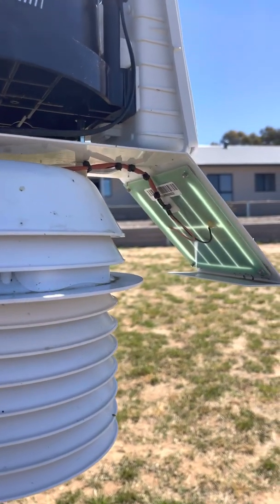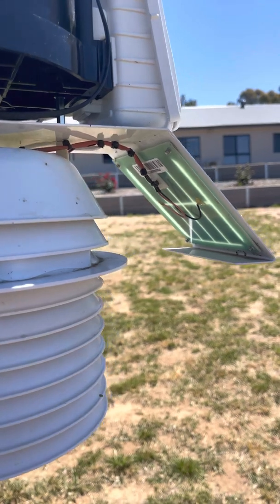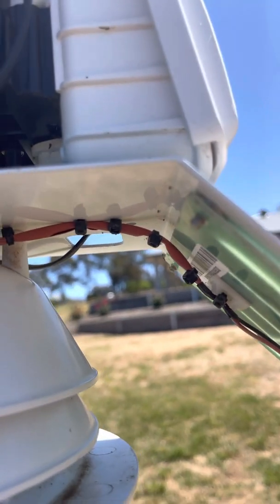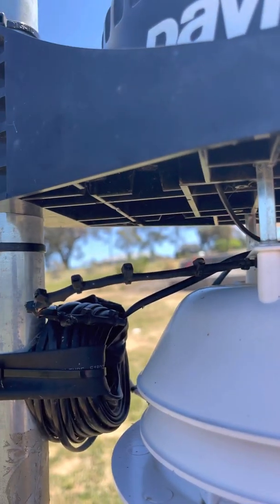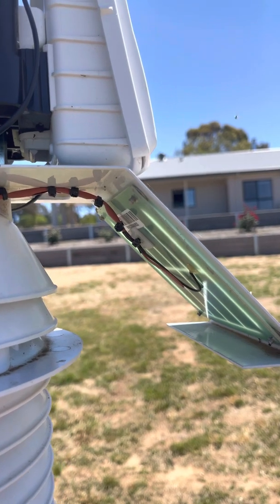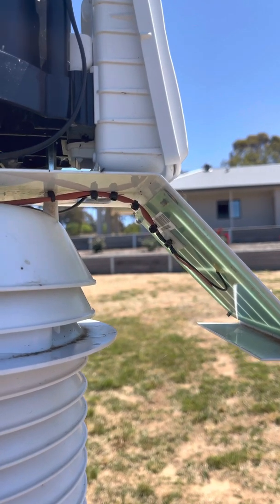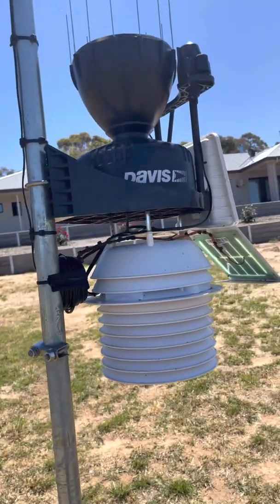If anyone from Davis is watching this video, that's definitely a room for improvement. What I've tried to do to mitigate the degradation to the sheath of the cable is put some heat shrink — this red heat shrink. I got a very small diameter heat shrink, sliced it down the middle, and have cable-tied that heat shrink on just to act as a barrier from rain but more importantly a barrier from UV, because UV really attacks everything. If left, it would eventually short out.